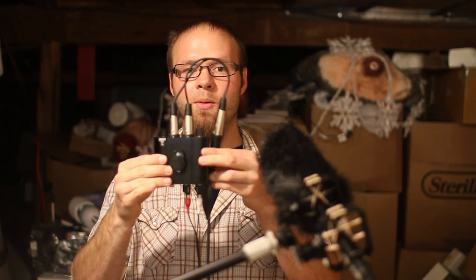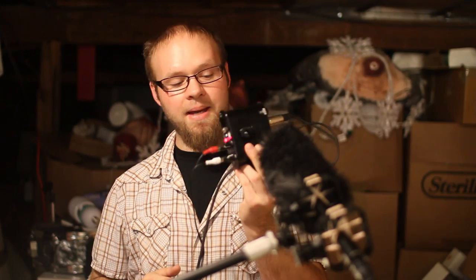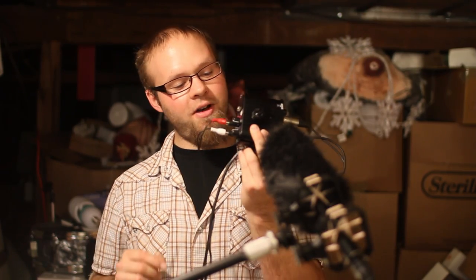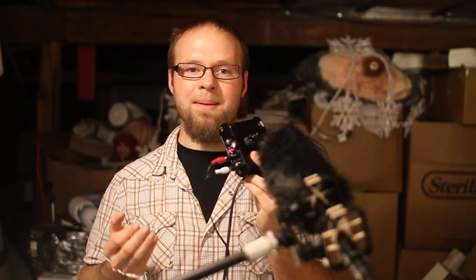For this test I've got this boom mic right here plugged into a Y splitter, which is then plugged into my ART USB Dual Preamp, and then out from two quarter-inch mono plugs to an eighth-inch stereo plug at the camera. I've got the volume set at about half — a little bit less than half — and I'm getting great levels out of my microphone right now.